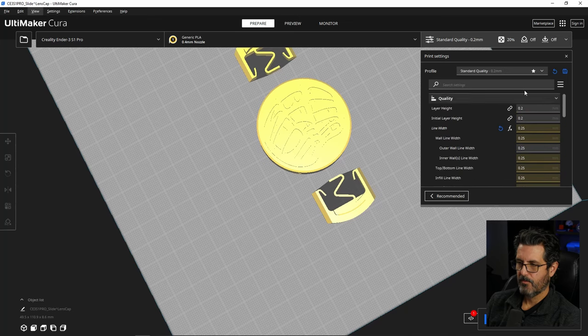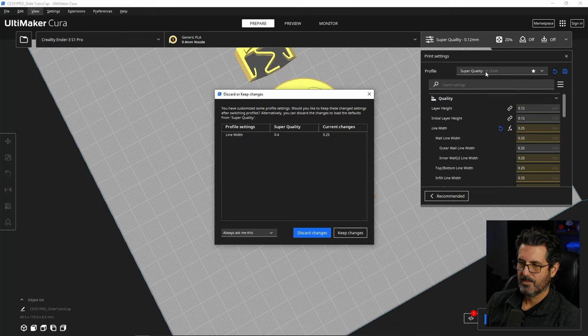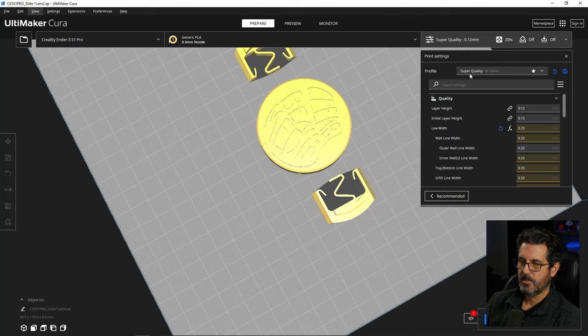So we'll do that and we'll change the layer height. We're just going to go 0.12. It just has to be less than the nozzle. So 0.2 would have worked, but I'm going to say keep changes because I just changed that. And that'll make it just a little bit nicer of a part and this a little bit cleaner. So anyway,